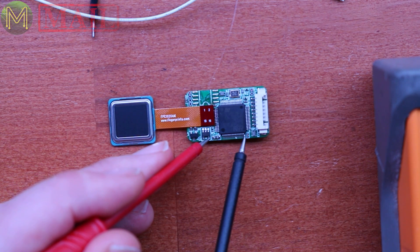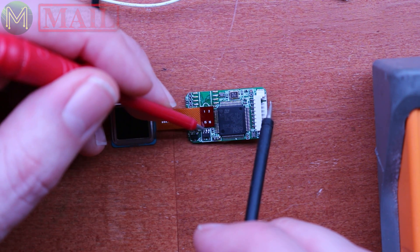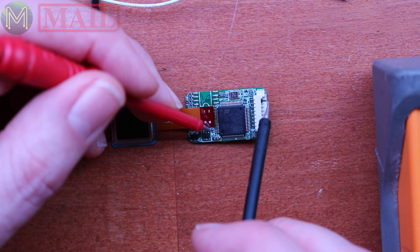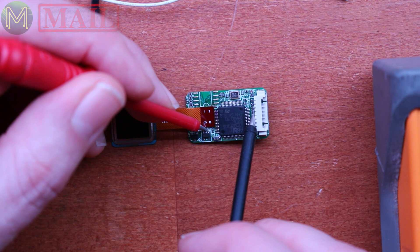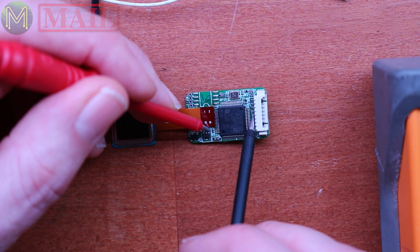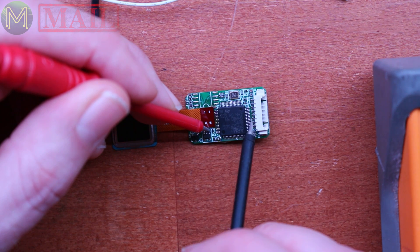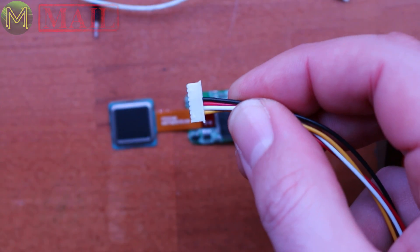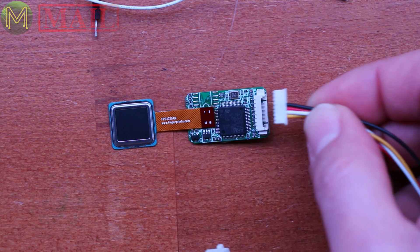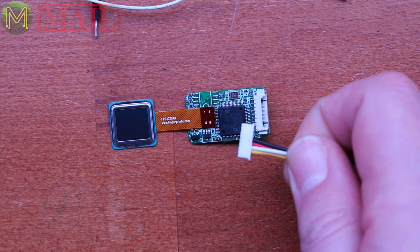So that's VCC coming in. Going backwards from that, without even looking at the datasheet, I'm just assuming one of these pins will be connected to the input voltage supply. The middle pin is ground. So at least we've got ground and VCC — they are the two middle pins, pin 4 and 5 working from the top down. It looks like the Grove connector was actually correctly wired but ran the wrong way. They thought the connector was going in one way but it actually goes the other way. So a bit of rewiring and let's see how it goes.